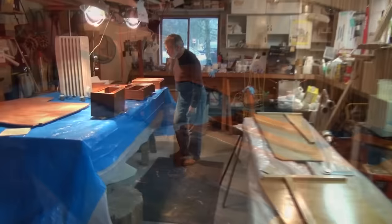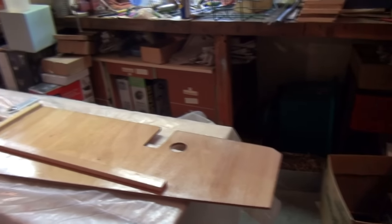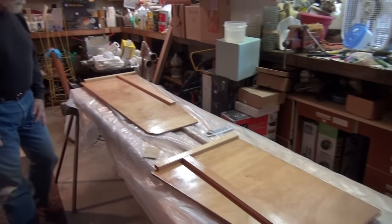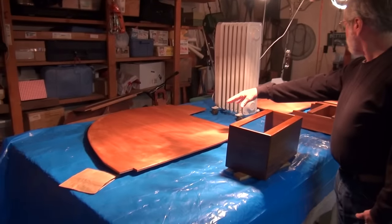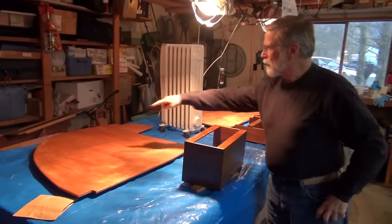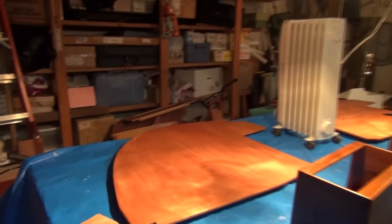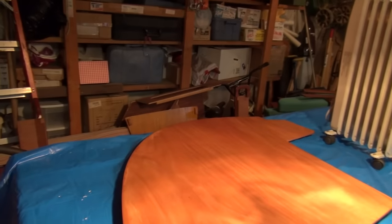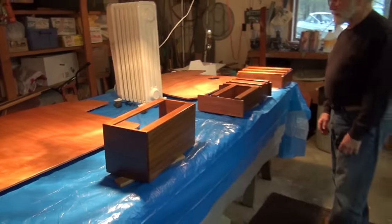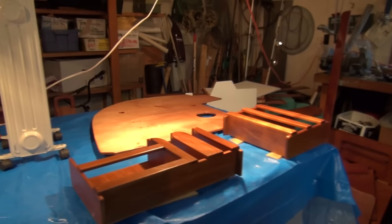These will get at least two more coats of varnish; we'll try to do the second one this afternoon. Hey Tom, what we accomplished today — we got the last coat of primer sealer penetrating resin on here, and the first coat of epoxy resin on these two big pieces. It looks like there's a thin spot up there, but that's okay — that's why we put three coats on. We also got the third coat of varnish on these teak racks; they're looking pretty good.